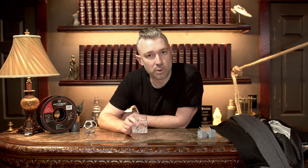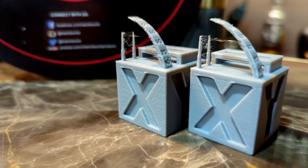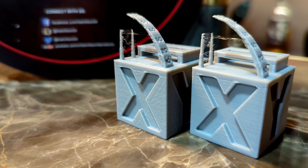I believe there are three things happening here. First, we know from testing both extremes of the spectrum that input shaping is in fact having a noticeable difference on our quality. Second, the kinematic system of the CoreXY format seems to be a more stable kinematic system compared to older formats in the 3D printing space. And lastly, I believe it comes down to the printer itself — this Adventure 5M is nearing almost 6,000 hours over the last year of 3D printing.